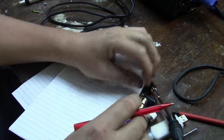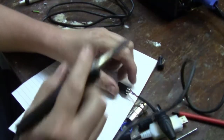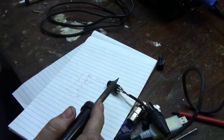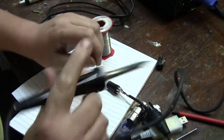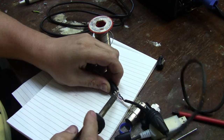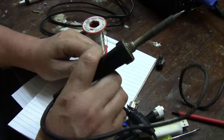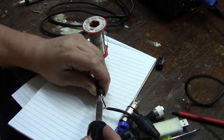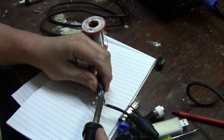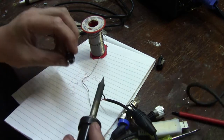So this is easy — we're going to take this connector off and connect it to pins one, two, and three and we are done. Why is my soldering iron struggling? It looks like they have used unleaded solder here, because I believe this is made in the UK. It's a nightmare for the soldering iron to melt this, because leaded solder uses a lower temperature than unleaded solder. Let me just remove these wire ends.